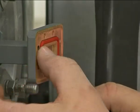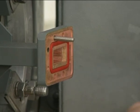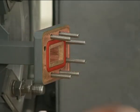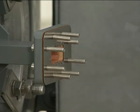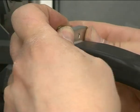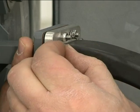Insert the rubber seals in the grooves of the feed and the flexible waveguide connector and make sure they're seated correctly. Insert the bolts from the feed side and slide the metal shim over them. Position the flexible waveguide connector and fasten it in place with the nuts and washers. Tighten everything by hand for now.